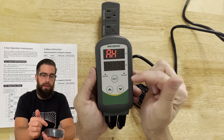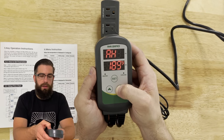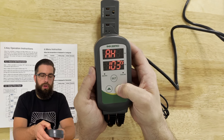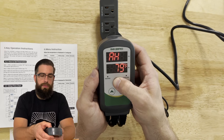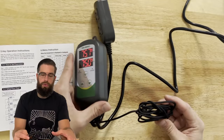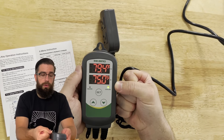The next setting is alarm high. The alarm will go off if it reaches 248 degrees, but that's way too high for what we're doing. As a little test, since we have it set at 75 degrees, let's set the alarm at 79. I'm thinking if I hold the thermometer for a moment, my palm will raise the process value and an alarm will go off just like that.